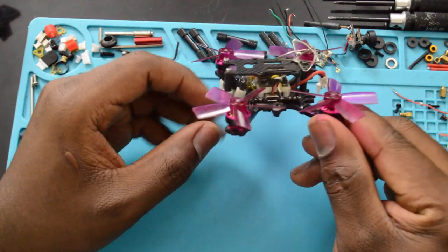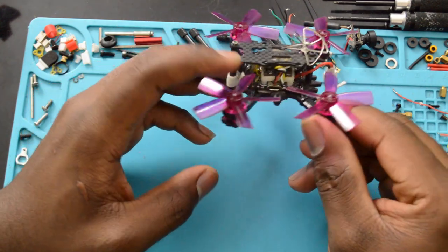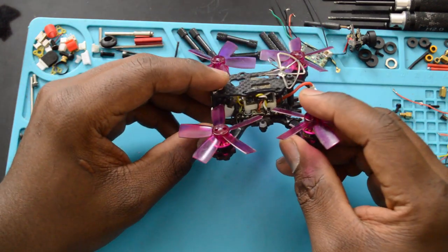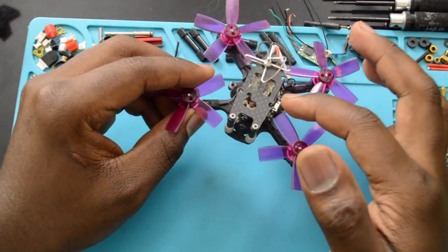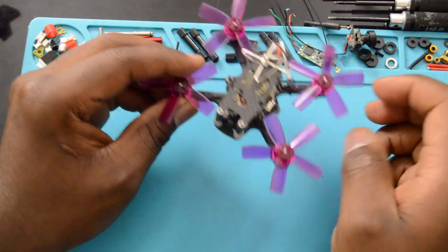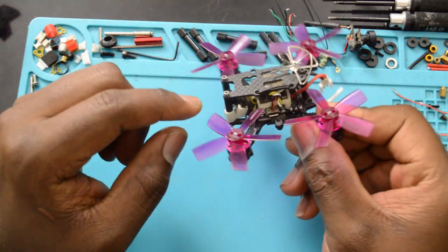I have the Bull Clash F02. It's the micro camera and the separated VTX. It's a really nice plug and play system, no soldering necessary. Only from the VTX to your 5-volt pad on the board on your flight controller, so that's awesome. The camera just plugs right in.